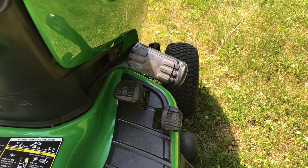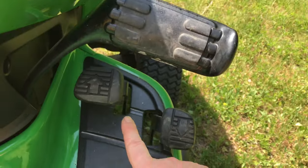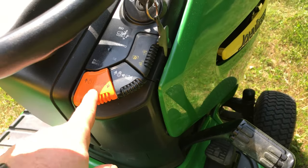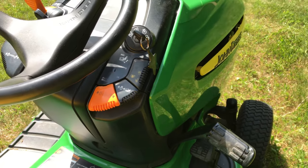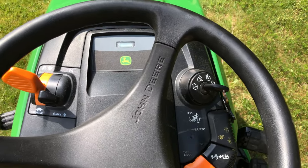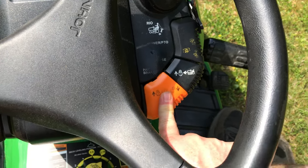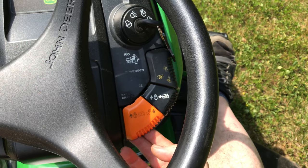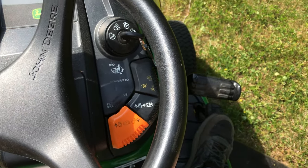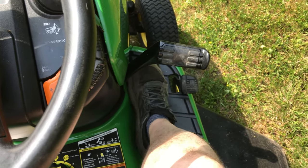On this side of the machine is your brake and your forward and reverse hydrostatic pedals. This is your brake pedal, this is forward, and this is reverse. There are some controls up here that go alongside those pedals. Looking at the driver's console on the right hand side, this bottom orange one is your parking brake. Push the brake, lift up on this, and the parking brake is engaged. You have to release the parking brake in order to push your hydrostatic pedals — reverse and forward.